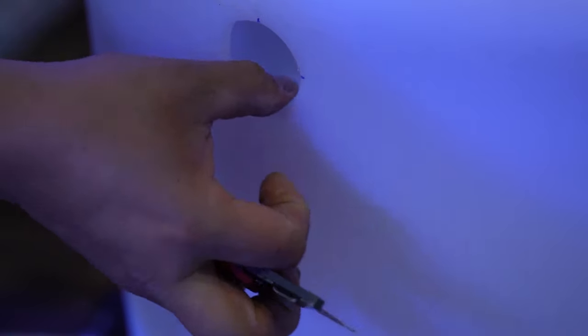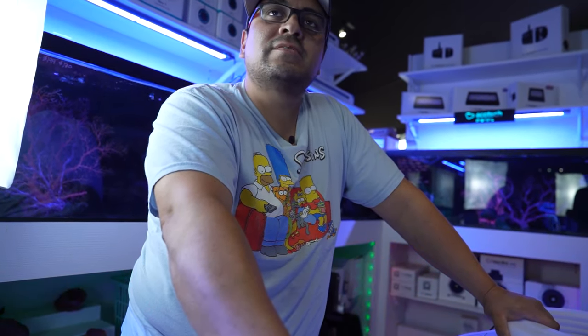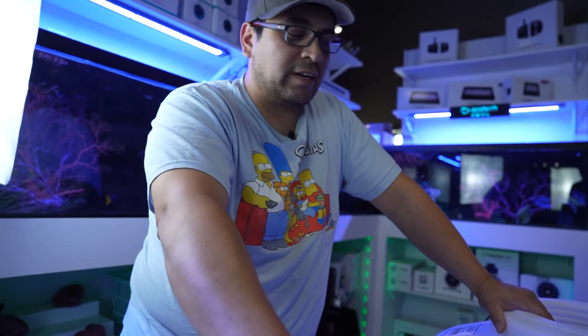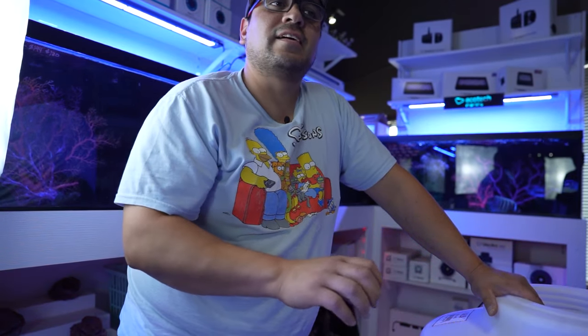If you have any sort of leftovers, I like to trim them off. And at the end, you can always take everything apart and flip over your tanks and get all the stuff out that you want to get out. Wash them if they're dirty. Anyways, that looks good. 1 inch uniseal just pushes right in, I think. There it is. Now for this part, sounds dirty, but you're gonna need some sort of a lube. Maybe olive oil or canola oil or anything that you can put in your uniseal, and you can get your pipe in a lot easier.